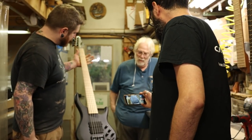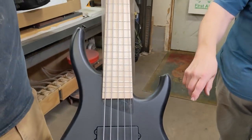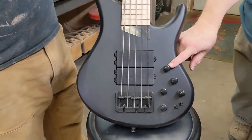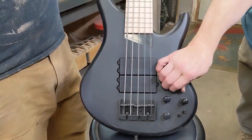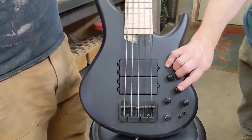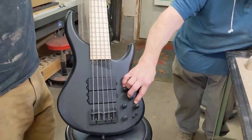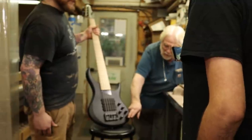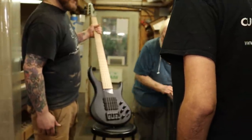Instead of knobs. The difference in the preamp is also that it's volume, blend, passive tone that works all the time, mid-range with a push-pull at 400 and 800 hertz, stacked treble and bass, and the switches are series single coil, parallel. Single coil in the middle, parallel up. Nice.